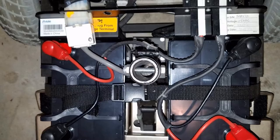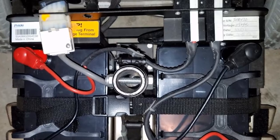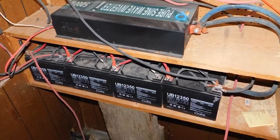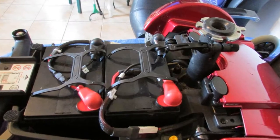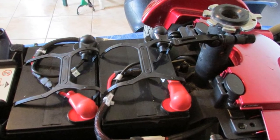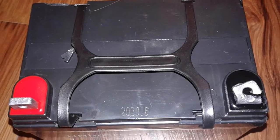Additionally, because this battery is also made with AGM technology, it comprises exclusive features only found in AGM models. Being in sharp contrast with former lead acid batteries, which flood electrodes uncontrollably, this UPG UB12350 possesses a glass mat. The function of this glass mat is to avoid leakage of acid. Instead of being absorbed by outdated lead acid batteries, the electrolyte in AGM ones will be kept still by the glass mats, so there's no chance for it to spill out.